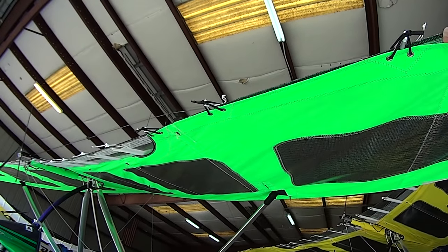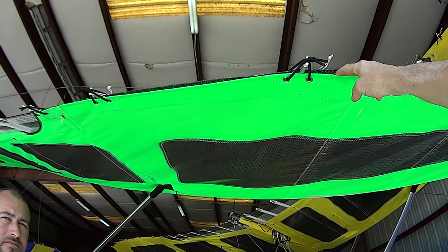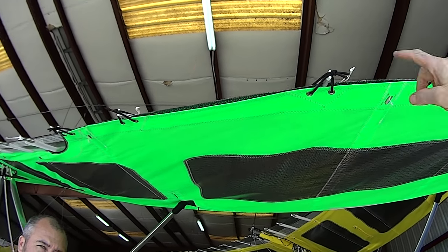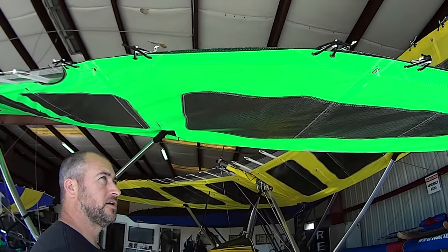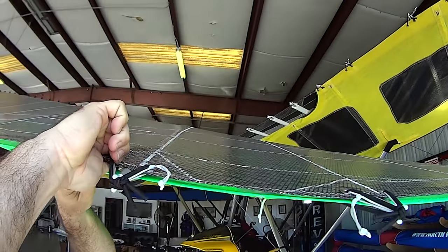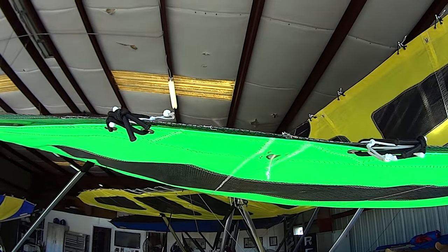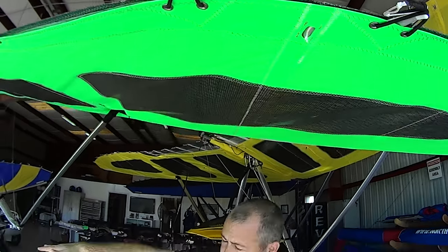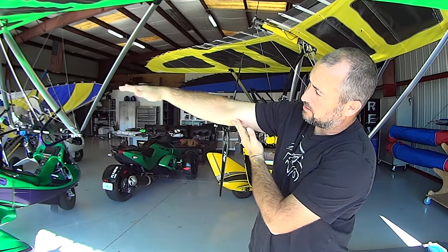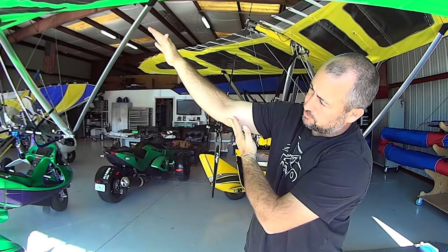This area on both tips is full surface and it's not sewn together — if it were sewn it wouldn't fly as well. The bungee cord is basically a way to spring-load the undersurface. With a single surface wing, the undersurface and upper surface can billow very easily and there's really not a lot to stop the trailing edge from coming up and down.